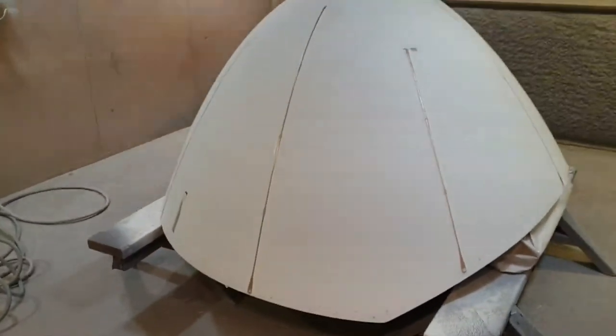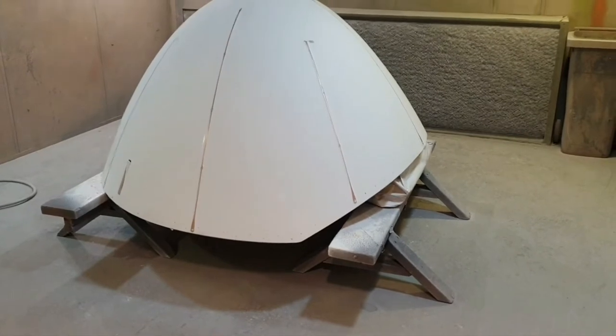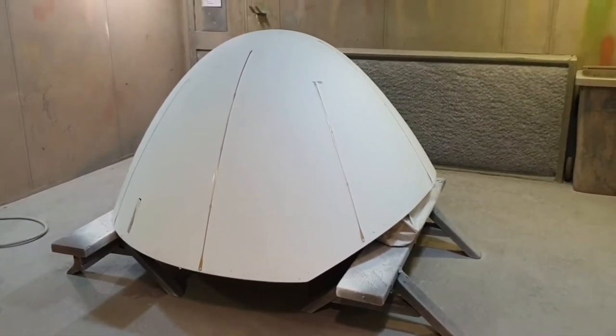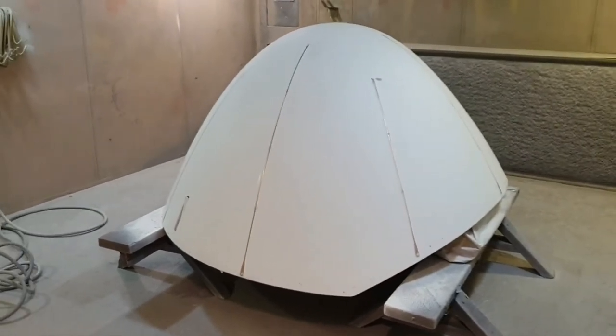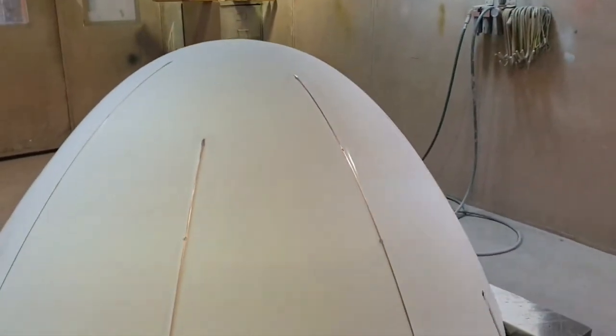The only thing I've got to put on there — I'll spray a little bit of reactive primer back onto them, and then the anti-static goes over them, and then obviously the top coat goes over them. But that is all that is allowed over the top of them — basically all coats apart from the surfacer. I'll film again once I've got the anti-static mixed up and ready to go.